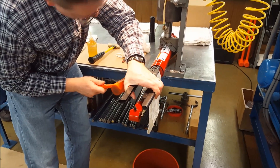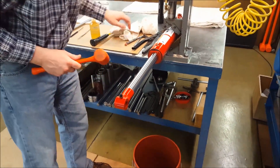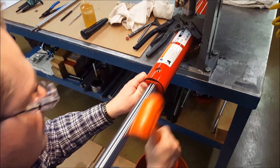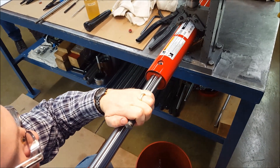Use the special pliers to once again compress the snap ring and tap it past the tip of the tube until the snap ring seats in the groove. Visually confirm the snap ring is in place by confirming the presence of a gap between the open ends of the snap ring. Take the time to test for any internal or external leaks before reinstalling the repaired cylinder.